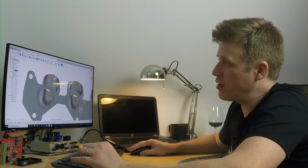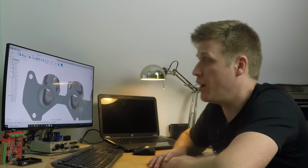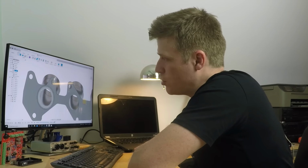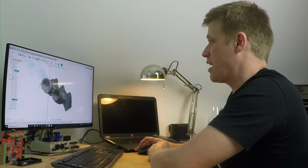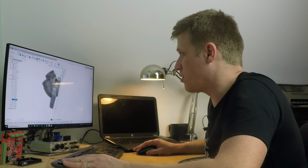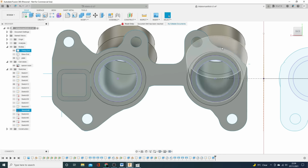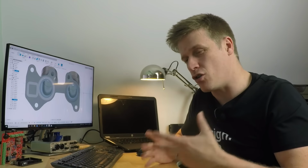If you find that your O-rings are too big or you want bigger O-rings, then you can again change the shape of the flange, give yourself some more meat on the material and go all the way around, which is incidentally what I had to do. Because when you go into the 3D printing slicer, you need to make sure that when you're spanning this section, you're not going straight up onto walls. If you've got a lot of walls like I did, this is the actual model that I did. If I flip around this side and go to there, you can see I've increased the diameter there, and I've given myself a lot more meat and a lot more space on the inside, to the point where I was running out of flat on the head. But again, guys, that's down to you really understanding your engine and your application.